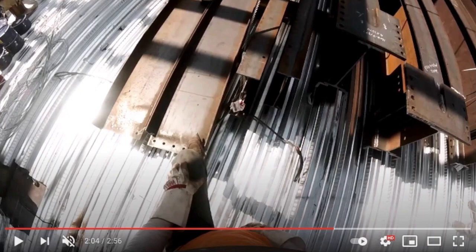I mean, sometimes you got to put your hand on it if it's a funky hook, but this is a routine hook, not on dirt or anything. We're on a deck floor. This is ideal circumstance right here. You can just put your foot on it and wait for your fall man to give you some up. So as I'm sitting there waiting, I'm telling my fall man, yep, I'm looking good, liking it, continuously talking to him and continuously talking to my partner.